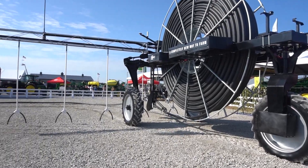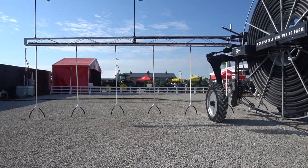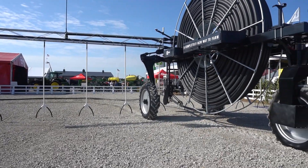That's totally different than what you'd see through a pivot that's putting water in the air. The fact that we're banding it next to the root, you've got to take it times two. So putting a half inch next to the root once a week is really equivalent to an inch of water.